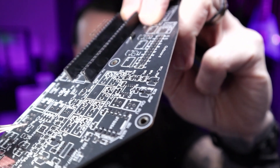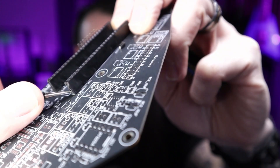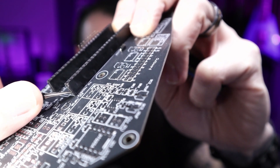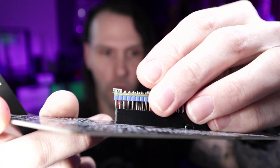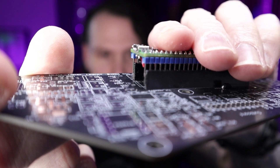But there was one thing I didn't anticipate. If you look at this board, there is this little part where I had to break off a section — you have this big long strip and you just cut it where you need it when using these headers. I ended up putting it on misaligned. Can't be that big of a deal, right? Yes, it is — it's a very big deal. I have enough dead Teensies at this moment to start my own tiny Teensy graveyard.